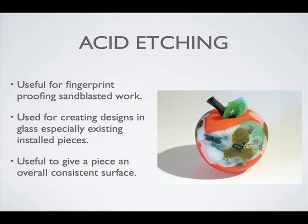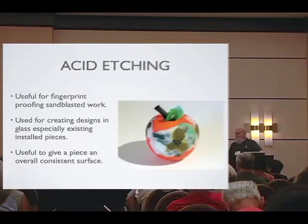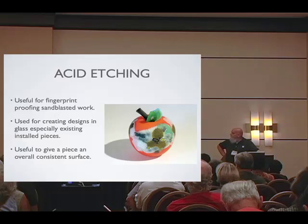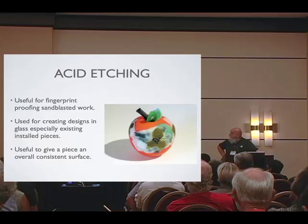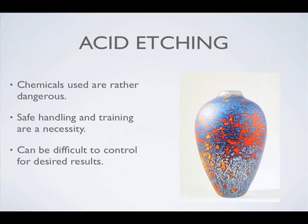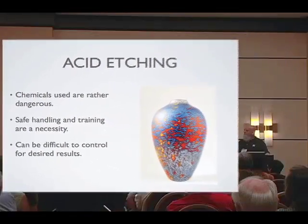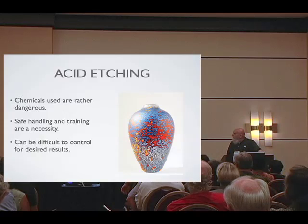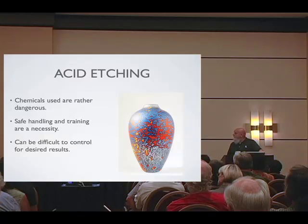Acid etching is another way of working on the surface of glass to give a nice smooth satin finish. There's an apple by Richard Ritter — he creates his forms and then immerses them in a hydrofluoric etching solution. It's not something you want to get on your hands because it loves to be absorbed into your skin and go back and visit your bones. Painful. But the surface is very uniform — smooth matte finish. Acid etching will etch different colors differently; you may find the black will etch but the white will not, and the red is kind of iffy. In that case, a lot of people will give their glass a light sandblasting first and then acid etch it to get the finish they want. It is toxic and dangerous and needs to be done with good housekeeping and safety rules.